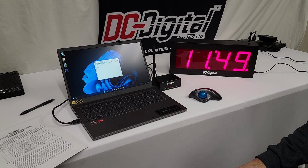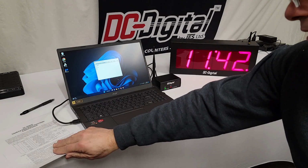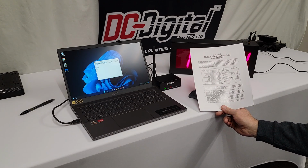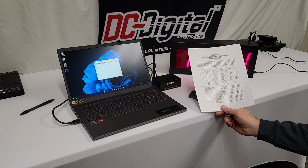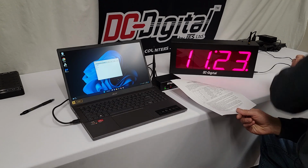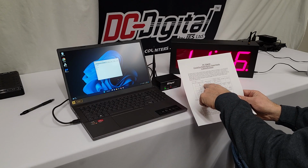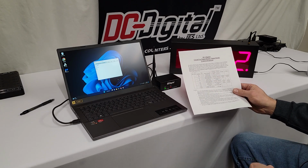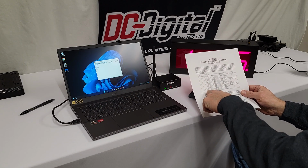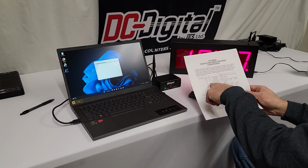And currently I've got in TD, a T down timer, and I put in 21:59 minutes. So on your cheat sheet here, we'll just do a count up timer now. So we'll put in TU, and then 1 for set and start. So you've got TC, which is time of day clock, and you can put in 12-hour PM, 12-hour AM, 0, 1, or 2, and it's 24-hour format. And then TU for timer up, TD for timer down, and then TS for just static or your counter functionality. So I'm going to put in TU, and I'm going to put in 1, which is set and start timer.